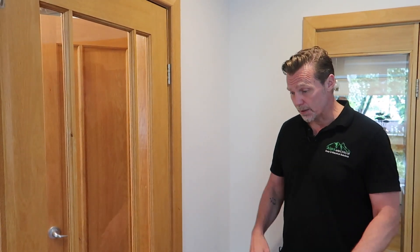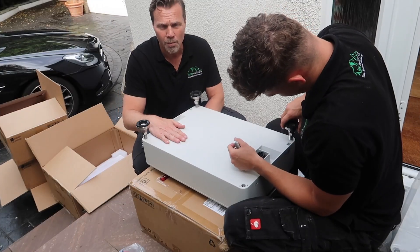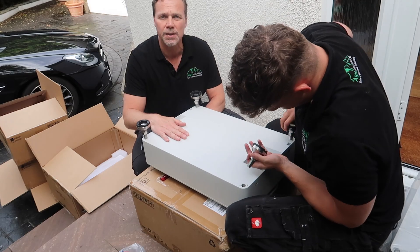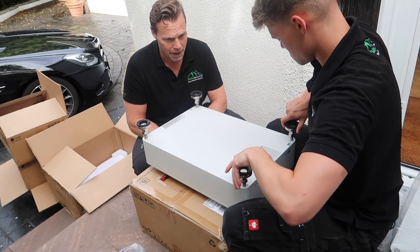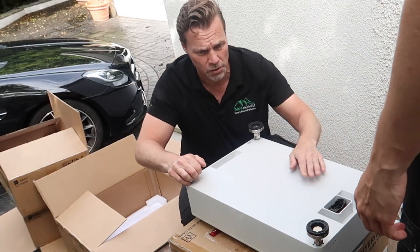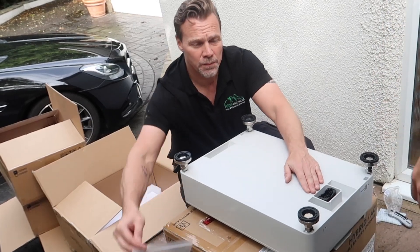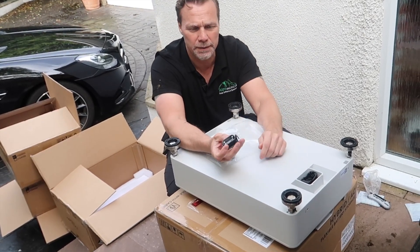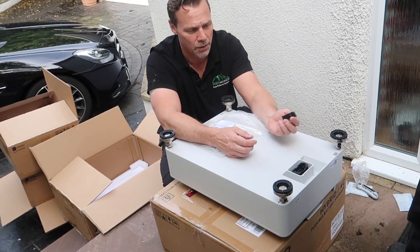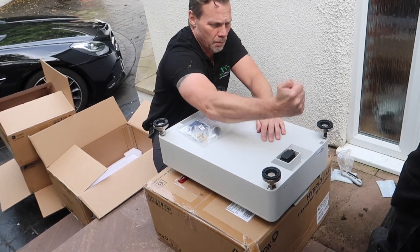So we're going to make a start — we're going to get the batteries in and out of the boxes, stack them, position the inverter, and work backwards. The last thing we'll do is connect into the board. We've got one master and three slaves here, so you can choose any of the slaves to put your legs on. We're just opening them all outside and then we'll transport them in one by one and put them in position. Each leg obviously adjusts, so if it is uneven in there we can sort that. And you must remember — on your very bottom battery you must put this little plug in, because it connects the positive and negative together; it's like your link, otherwise the batteries won't work. That just goes into the bottom there — that's that.